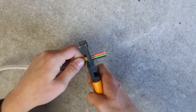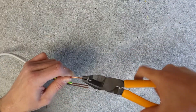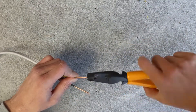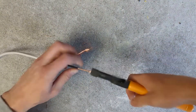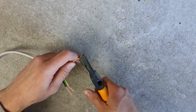Me stripping isn't just pressing the pliers down on the outer sheath and then stripping the thermoplastic sheath off. There are two motions: there's the pinching, and then there's letting go of the pliers a little bit to release tension on the cut, and then stripping the outer sheath off. That is the smoothest way to do it. Same thing with the inner insulation, but you may need to put a bit more pressure on the stripping part.